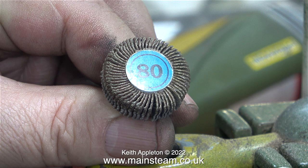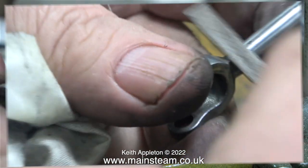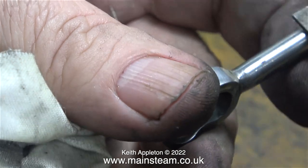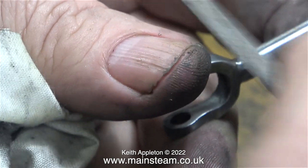The next flapper wheel is much gentler, and this actually polishes the connecting rod and gives it a better finish. In this clip I'm using a small needle file to remove some of the marks in the shaft. This is a very tedious job and it's certainly not quick.